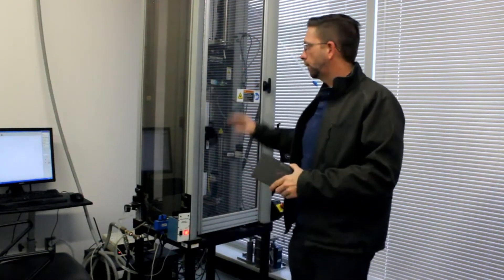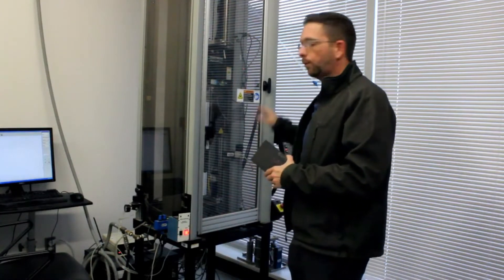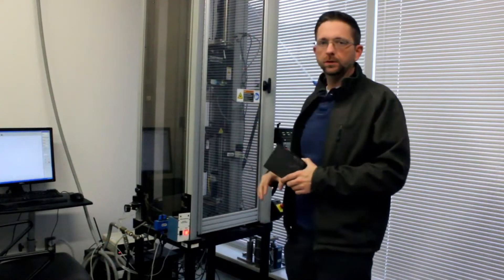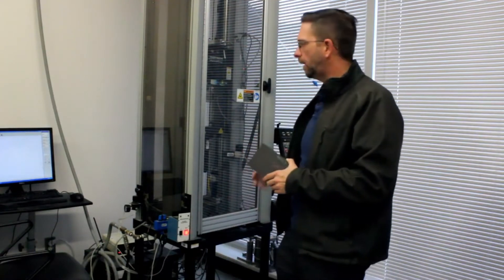It's a very simple test specimen — four inches by six inches. The first thing you would do is take your specimen, cut on the water jet, that's how we would do it here, and bring it to our impact machine. This is a 9250G Instron drop weight impact test machine. There's no spring load action; it's all gravity driven, adding weights to increase energy. We have variable sizes for our impactor and a 5,000 pound impact load cell here.